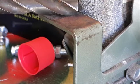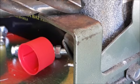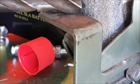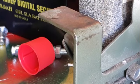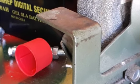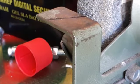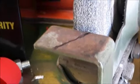So let's sharpen one and see how it comes out. To make a nice 60-degree angle, I haven't got a nice tool handy with the right angle, so I'm using this unused drill bit and I hold it against the grinder stone and then I will just mark more or less the crease — something like that. Then I can get a straight piece of paper here. Okay, there's my 60-degree angle, and that's what I'm going to use now to sharpen one of the drill bits.